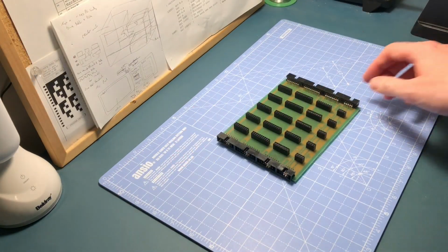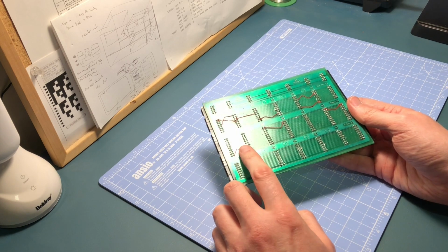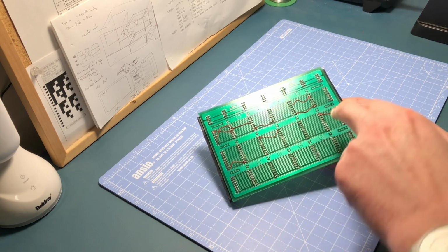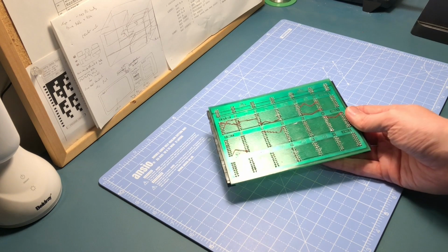Okay, so that's it. That's the board pretty much fully tested. So there's a few more wire links I had to add. There's one down here. This I did see a pad was slightly broken over there, so there's a wire link for that one. This one over here, I've no idea why there's a break on there, but for some reason there is. But anyway, they're all done.